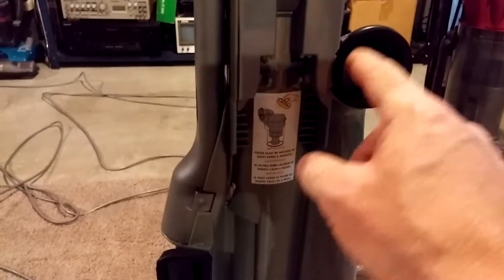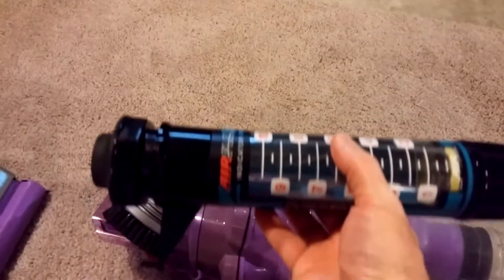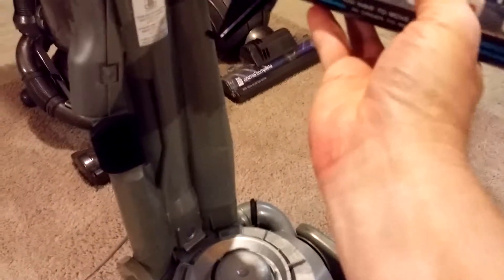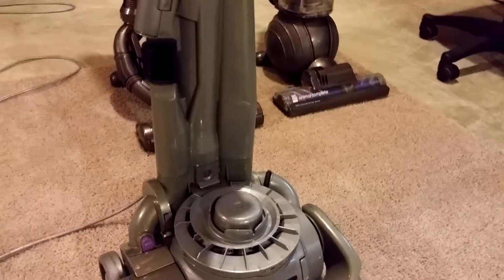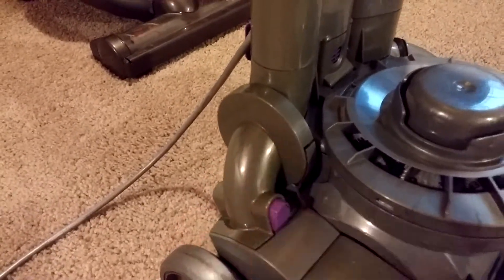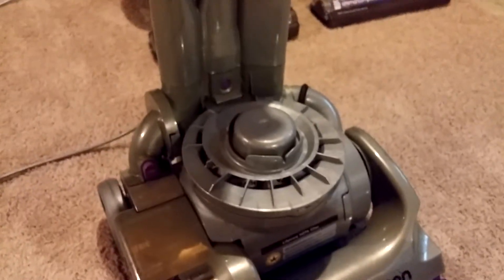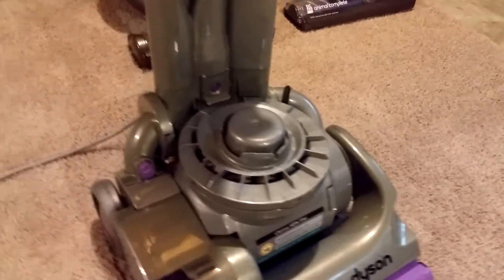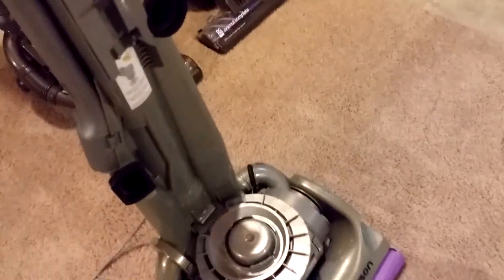Is there a whole lot of loss, or is it very little? The DC-14 is easy to measure with the Baird meter because I can fit it in quickly and show you what's going on. I can also measure the other ones with my anemometer, and I can take this piece off and measure the side port after the cyclone — pretty easy to do. So let's see: we've got this big powerful motor down here creating a bunch of airflow. Let's see what it measures.